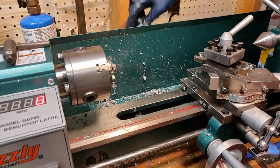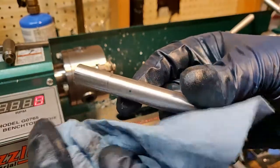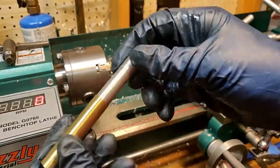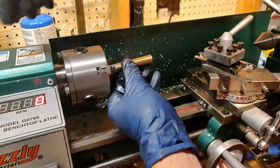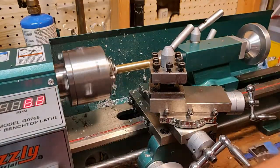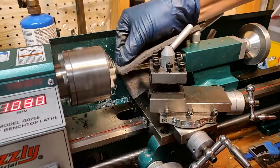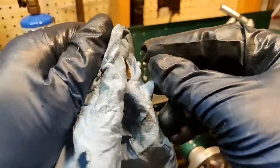Now I will show you what this part looks like after a quick cleanup. The outer diameter of the longer portion of this mandrel now closely matches the inner diameter of our slide tube, which means that it won't fall off very easily, especially with the small lip that I created at the end. When I bring up the tail stock I make sure to lock the tail stock as well as the quill to help support the work better. Now I can apply a high quality brushed finish without having to worry about the tube collapsing when I go through the different grits of sandpaper and finish off with a scotch-brite pad. I'll clean this off with my favorite — not a sponsor — Goof Off, and now this is what that brushed finish looks like.